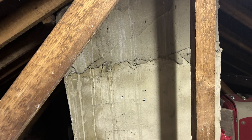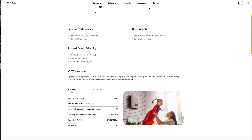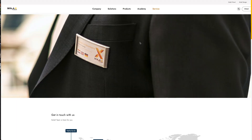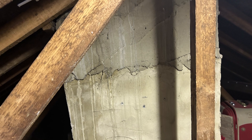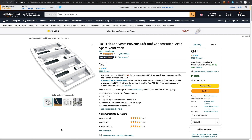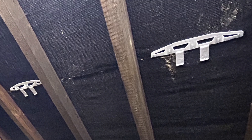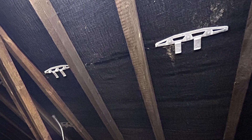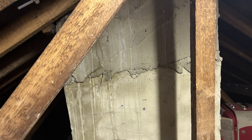I had considered putting it in the loft on the first install, but my loft can easily get to 40 degrees during the height of summer. So I contacted Solax and they said no problem at all — as long as it's ventilated, a loft install shouldn't be an issue. To increase airflow I bought ventilation airflow spacers that sit between the felt in the loft and open up the gap for air to flow. I bought two packs of 10, so 20 spacers, fitted every other rafter along both sides, which really increased the airflow and brought the temperature down.